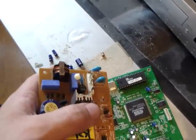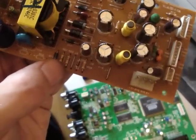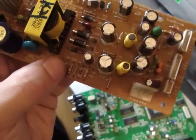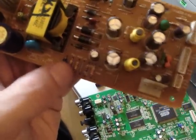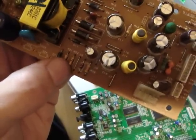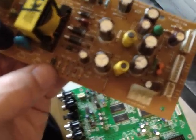What's nice about capacitors is they're really easy to read — they have all the information basically written on them. But other things, like these resistors, are a little bit more challenging to read. They have different band colors on them, and these are quite tricky to figure out exactly — like whether it's a 100k or 50k resistor. But if you get on the internet and check online, you can find out the ratings for the different multipliers for the bands and what resistance they have. You can put all the ones with 100k in one bag, 50k in another bag, and use those when you need them. Sometimes on some circuit boards it'll have the resistance printed on it, like 100k or 50k. These are still very useful components — you may want tweezers or very fine needle-nose pliers to pull them out because they're very hot when you're desoldering them.